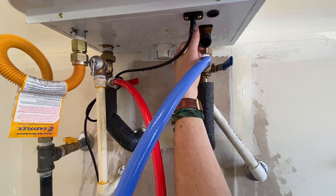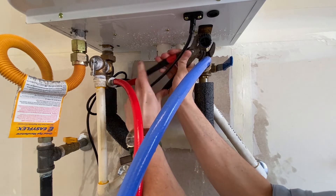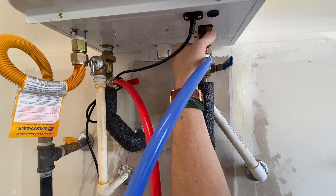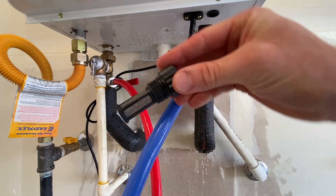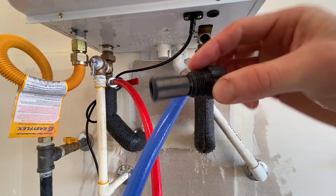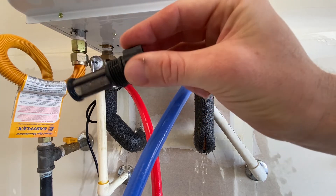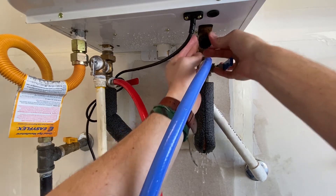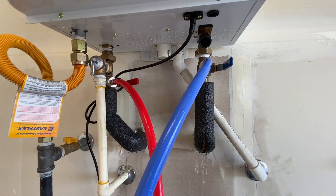This here is a pre-filter — it's the filter that filters the water that comes in from your city. Before we start anything, I'm going to take that off and clean it out. This filter did collect some debris, so I'm going to clean that out and put it back in. That way, any debris that's caught or present in the cleaning solution will be caught here before it cycles through your unit. I've got the inlet filter cleaned out, so I'm putting that back in. That's going to catch any unwanted particles in the cleaning solution before it goes into the hot water heater.